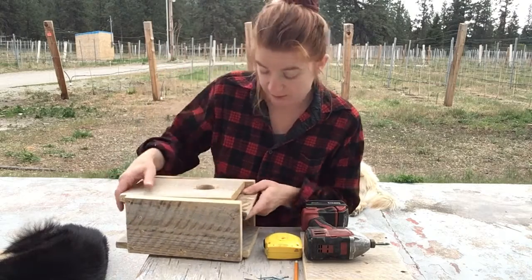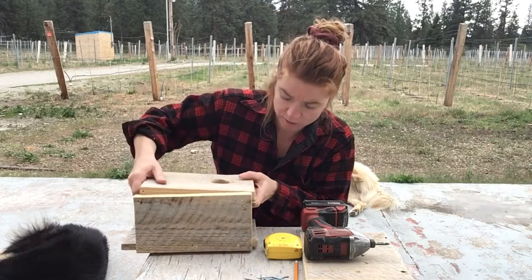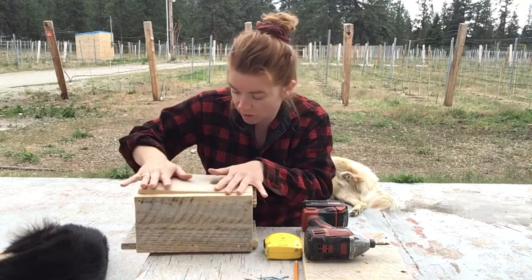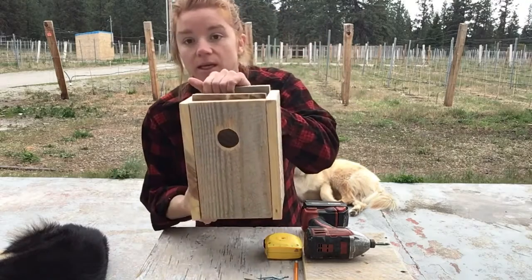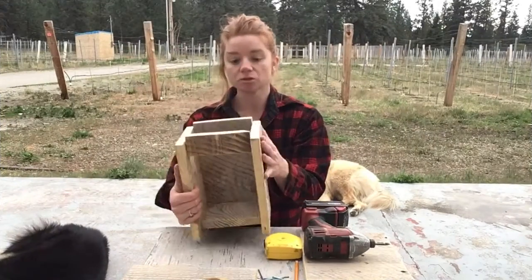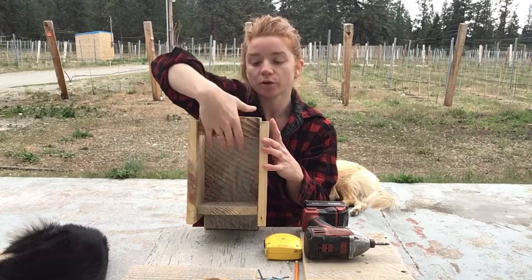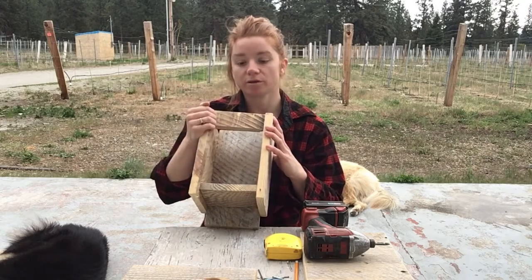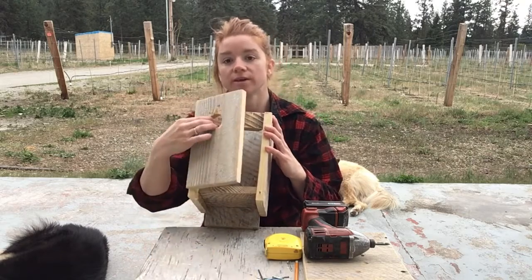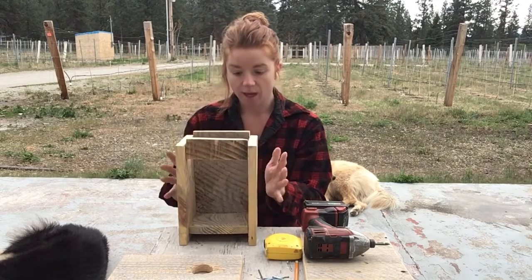You can see it's very tight — it secures the two side pieces nicely. Because there are only two screws in the top brace, make sure that it's vertical and not angled in or out, as that will affect how well the front piece sits when we put it on.